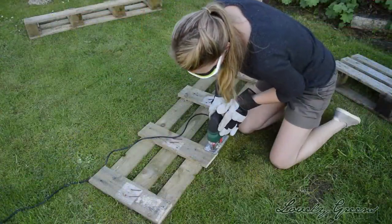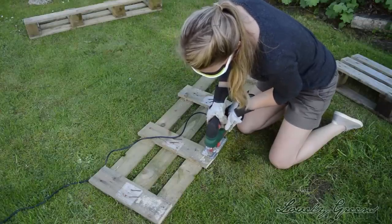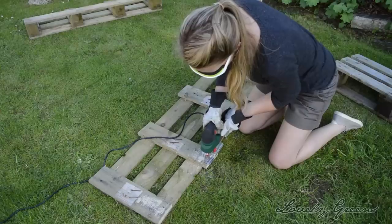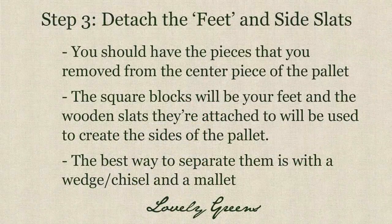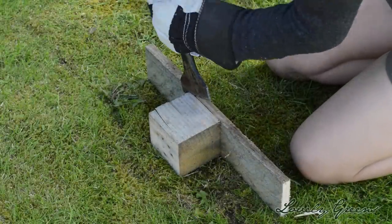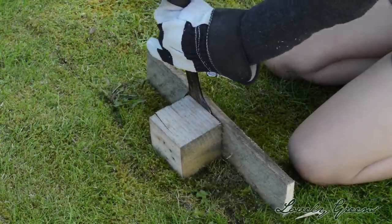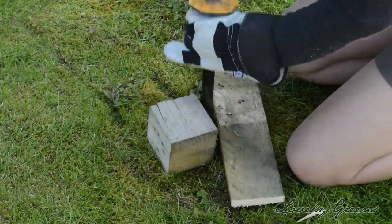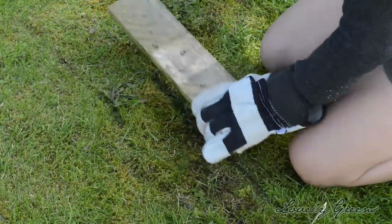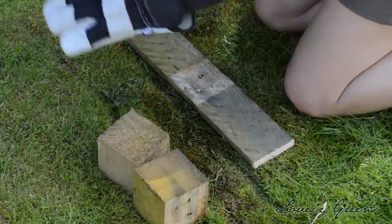On the center piece, you want to trim the sides with the jigsaw so that they're flush with the sides of the slats. Next, we have to detach the feet — those are the blocks you removed off the center piece. They're pretty difficult to get off, so I really recommend getting hold of a metal wedge or a chisel, and they'll make short work of the job — they'll go right through the nails. The palette will actually provide you, if you have the large one with nine slats, with four feet. Very handy.